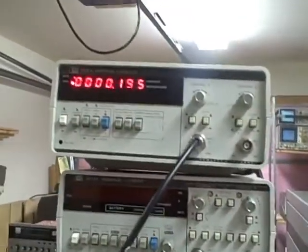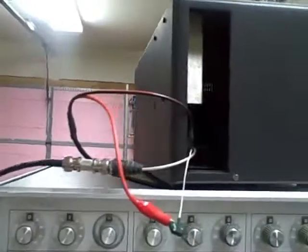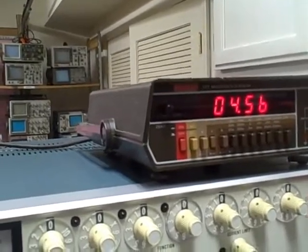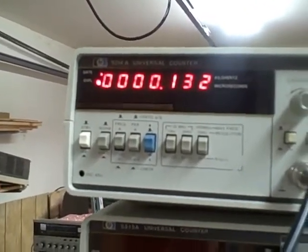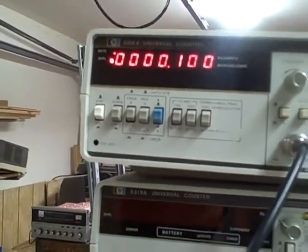We've applied a 10 MHz frequency onto this 5314 counter, and it's coming from this Rubidium frequency standard, which right now is in the unlock state. It was just turned on and it's heating up, and it's also sweeping through the frequencies slowly, going above and below. But in a moment it's going to lock, and when it does, I will have 10 MHz with 10 to the minus 8th accuracy.